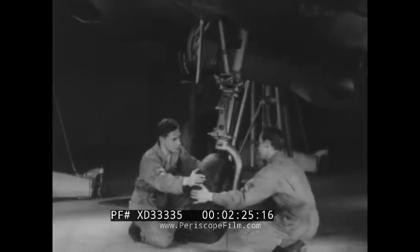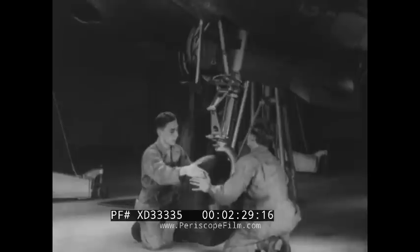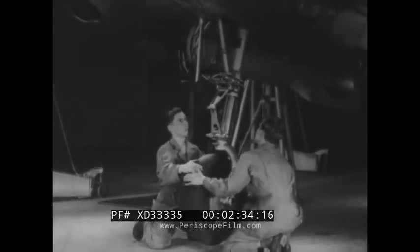When it is full, wipe off any excess fluid. Screw the filler plug partway back in and turn the nose wheel through its full steering arc. Do this at least twice to free any entrapped air. If more fluid is needed, add it at this time. If the damper is full, tighten the plug and wipe off all excessive fluid.